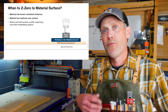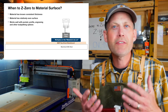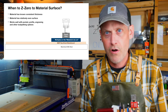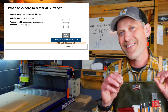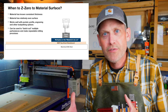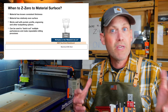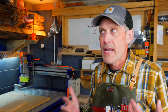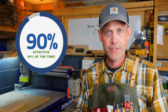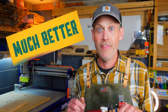The material surface method is well suited for pocket, profile, and engraving tool paths, but may not always be the best for something like a 3D carve or a two-sided milling operation. It's best used when you want to batch out parts or cut a couple of things from a perfectly even piece of plywood or hardwood. The material surface is going to be what you use 90 to 99% of the time. There are those times, however, when the machine bed makes for a much better option.